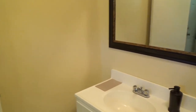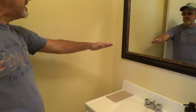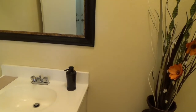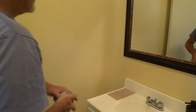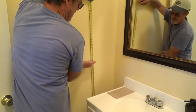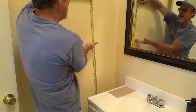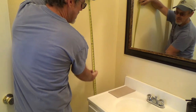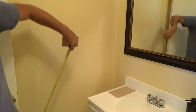You could put the paper towel holder on the right and the soap dispenser on the left, or vice versa depending on your layout. Keep in mind they'll stick out a bit depending on how close the sink is to the wall. Either way, the paper towel holder can be no higher than 40 inches — that's where the paper comes out. At 40 inches it seems low, but that's the requirement.